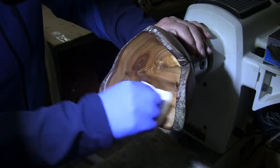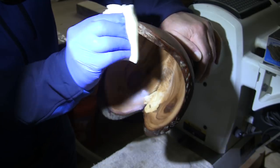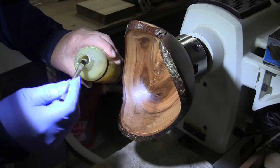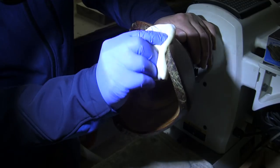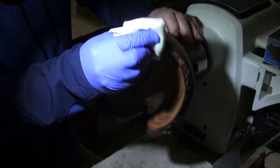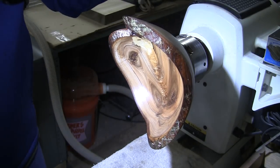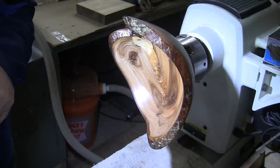That's some beautiful grain where the crotch is. There's a little chatoyance in there — pretty happy about that. I did sand the bark with my Sandoflex at 180 grit and it's nice and smooth and clean. I'm going to take a little brush and get in this little valley in the crotch. I'll put a second coat on the outside just in case I've disturbed anything with my sanding. No bug holes in this piece — none, zero. I'll put another coat on the outside, let it all dry, come out and buff it up, and then it'll be time to turn this around and remove that tenon.